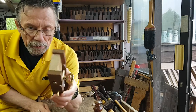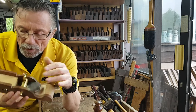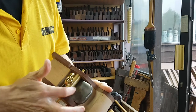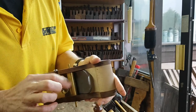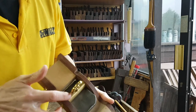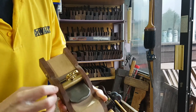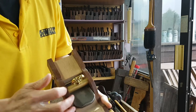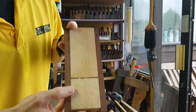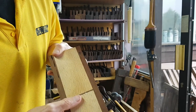This is a bit of a weird plane — a bevel-up Japanese plane — but the key thing about it is the iron holding mechanism. This knob is off some bit of furniture, but what it is is a cam lock. The bridge is cam-held between two sides, locking down a Japanese iron, and it's got an adjustable, rather crude Heath Robinson front mouth, but that's pretty tight.